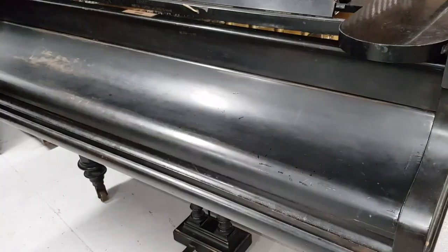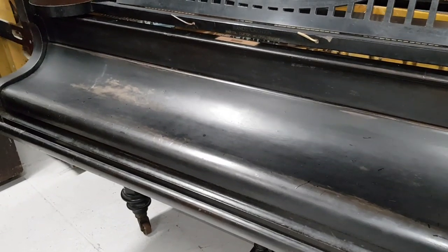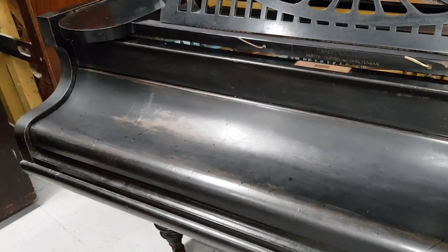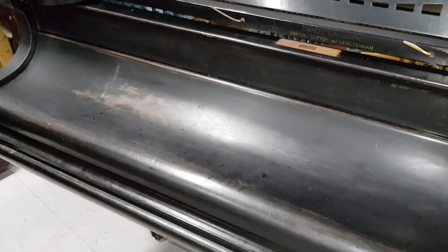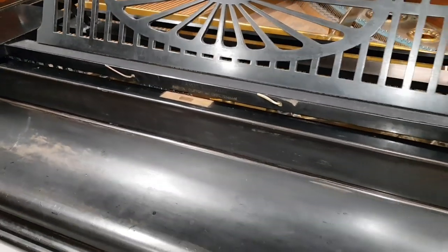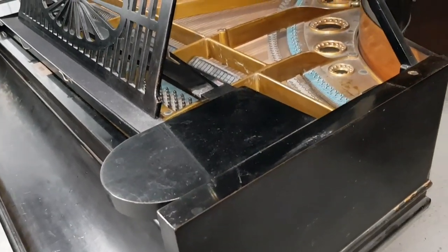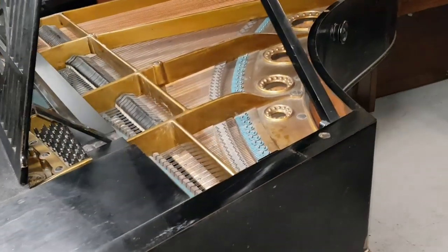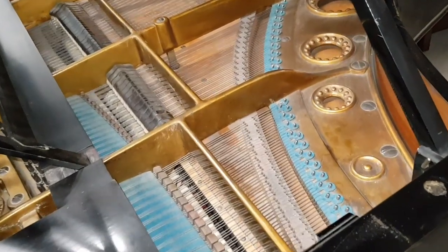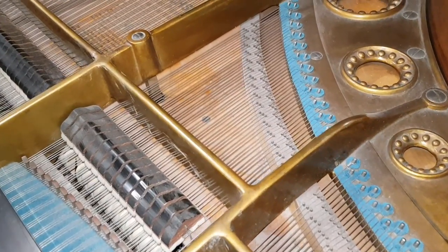Folding the lid back, the whole of it has obviously been kept closed and the finish has faded and the polish is worn completely off. It needs repolishing. We can do traditional French polishing, which actually costs more than the modern polyester shiny black finish. French polishing never looks completely perfect — you'll still see lines — whereas polyester is perfect. For a stock piano we wouldn't normally do French polish, but we have done it recently on a client's piano.